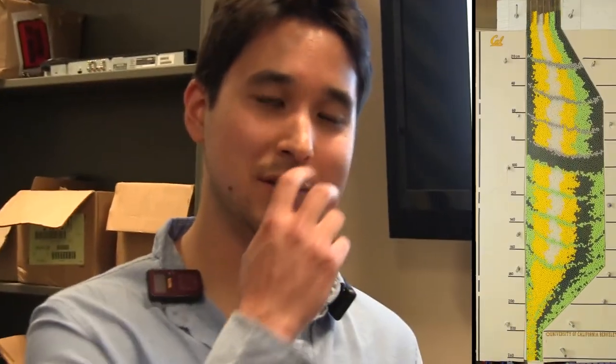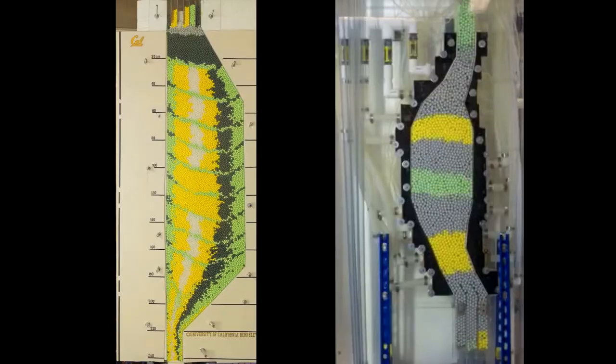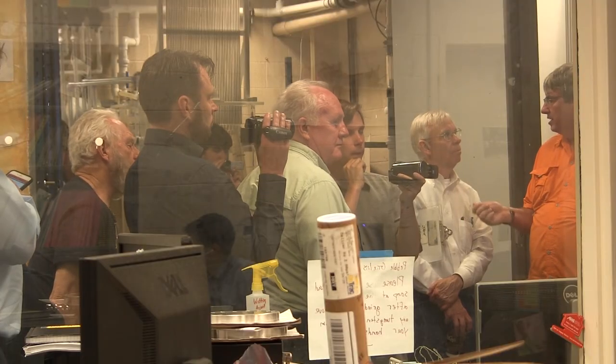So this project was built maybe 4 or 5 years ago, and we were considering a very complex core design. So this isn't like multiple fuel regions. Really in the middle, it's going to be just one type of fuel. Dark green were pure graphite pebbles for shielding. The green was a thorium blanket. There's a lot of potential, but the designs right now are much more simple, with just one fuel layer and one outer shielding layer. You couldn't actually do it then with the thorium. The PBFHR we're designing as a 19-point-something enriched U-235, so it's just uranium, yeah.